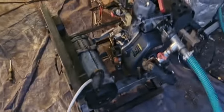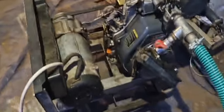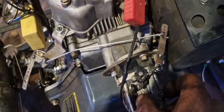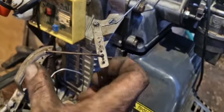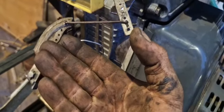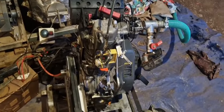Although its reaction with the governor is not that precise. There's quite a bit of hysteresis going on. I bet that's because of the spring inside this. Look, you see? It wants to turn itself back. Most of the time the thing will pull itself open, because there is another spring here, I believe. But it has to pull itself a bit and then it closes itself whenever the speed changes. I think the hysteresis spring can be done away with, so I'm gonna check out what that does.